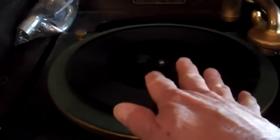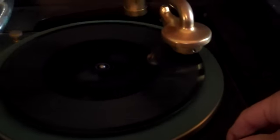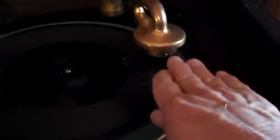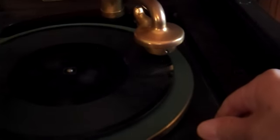He went ahead and sent it to me and it came in. I'm pretty sure this unit is operational. The old boy that had it before me redid the grill and everything looked really good. So I'm going to go ahead and turn it on and let you listen to it. I have a record here called My Sweet Sweeting Waltz — one of Edison's diamond disc records — and we're going to check out this old reproducer. I've already wound it up and it's now turning. This little handle right here — you push it down, and that enables you to move the reproducer back and forth across the record. When you get it where you want it, you lift up on the handle and it lowers the reproducer down on the record. You have to lower it down slowly — you don't want to lower it hard and fast or you'll damage the record and the stylus.